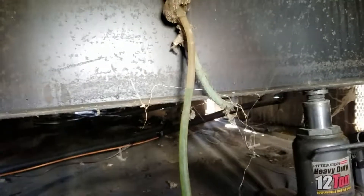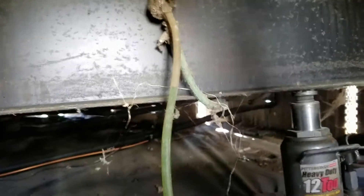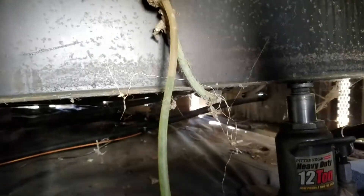Welcome to MVVista's mobile home leveling. We're on another double-wide leveling job here in Lafayette, Colorado. We're going through getting all I-beams level with the water leveler and using bottle jacks to lift the beam until it meets even with the water leveler.